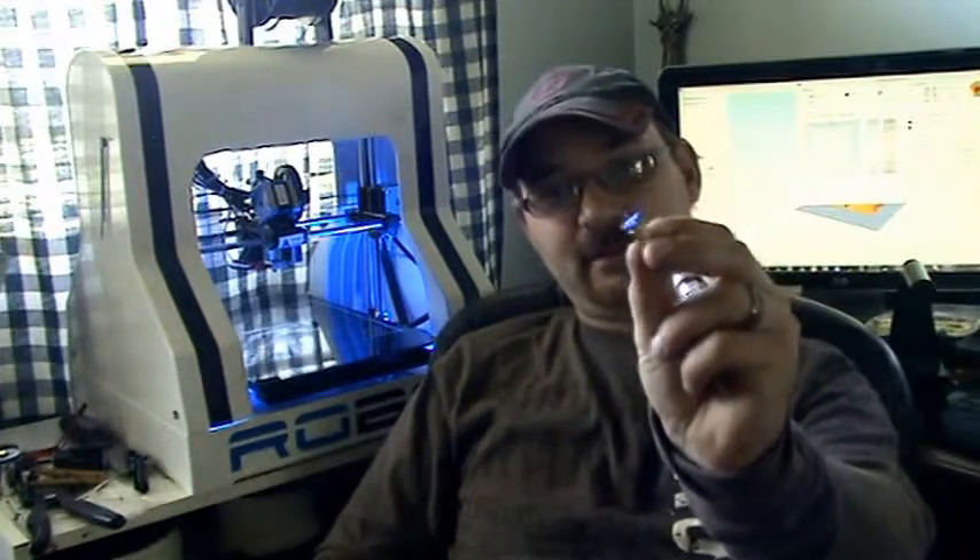It's all back together and running. To summarize: I wanted to hit points on moving the fan to the extruder gear side, and trimming down the fan bracket so they can both sit flush together. One point I forgot to mention in the install video is that the E3D printhead will come with a brass fitting of some sort - it has a quick-connect blue piece that helps guide the filament into the extruder. This won't fit in the main body that the extruder slides up into and screws into.